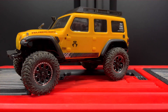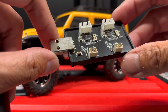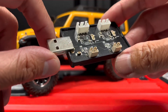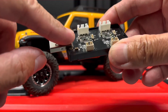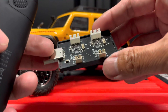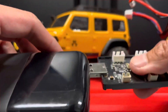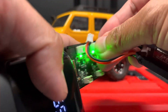For some of you, simple is going to be better. We're going to use a battery bank and this charge board from a company called Emax — this came with an Emax tiny whoop, but if you're buying it now it's about $13 plus tax and shipping, so around $16 to $18. I emailed Emax and they confirmed this charger will charge at 0.5 amps, which is about 1.5C for a 350 milliamp hour battery. It's fairly safe — you simply plug the balance lead in, similar to the stock charger, and that's it.